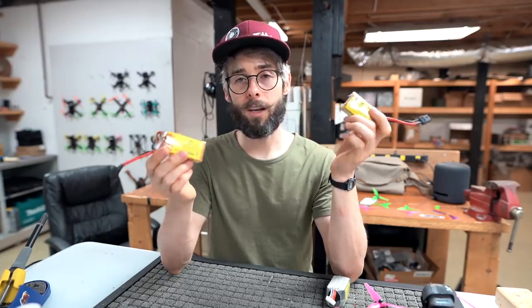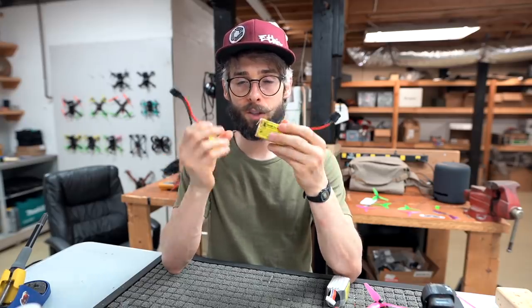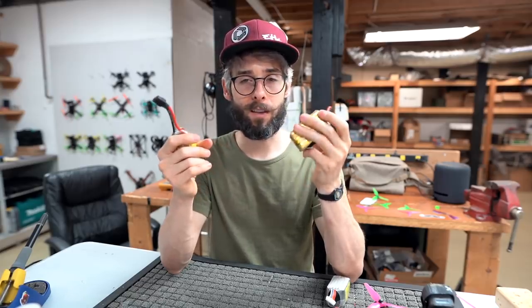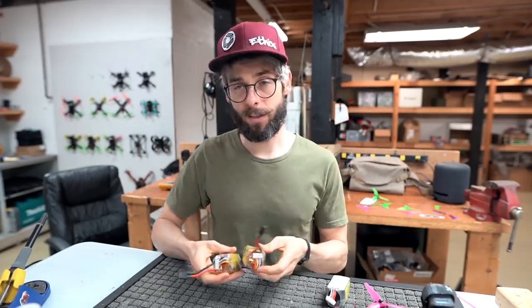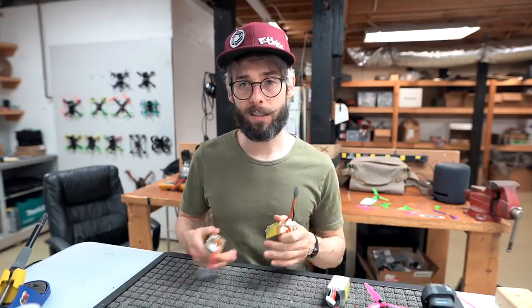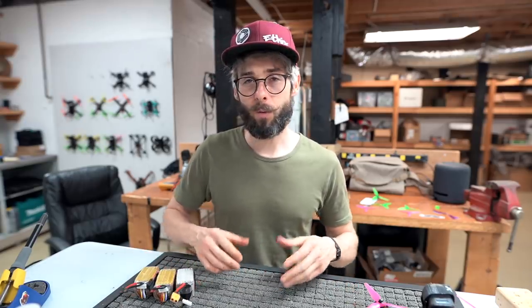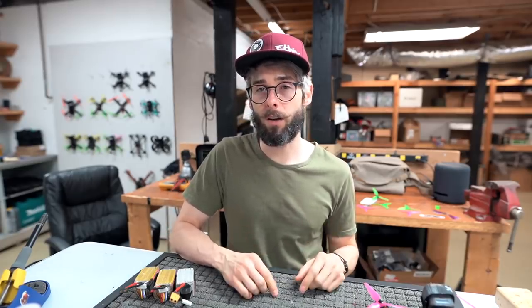When checking batteries, inspect the cells and make sure nothing is leaking - you can smell a sweet smell if lithium is leaking out. If a battery is super bent, you probably want to retire it; usually a heavily bent battery won't really come back. Check all cells periodically, and if you have a suspect battery keep an eye on it for a couple weeks to confirm it's solid. The main rule: don't leave batteries too charged for too long, and don't leave them discharged for too long.